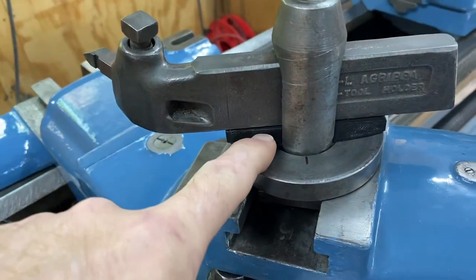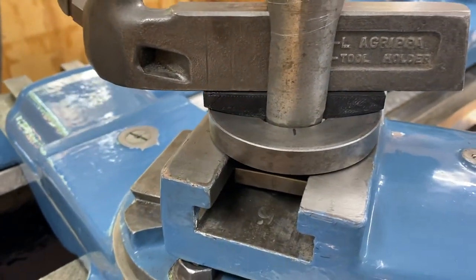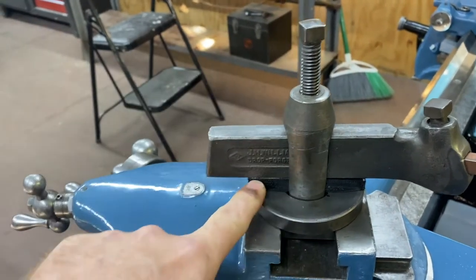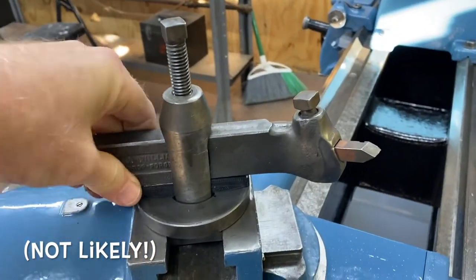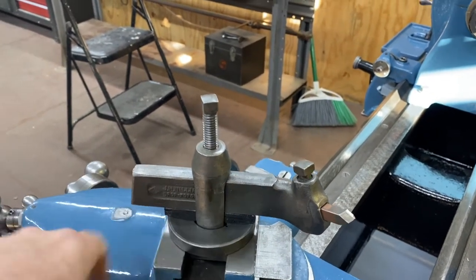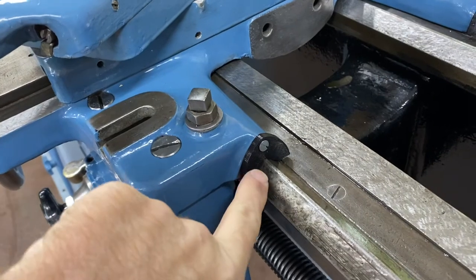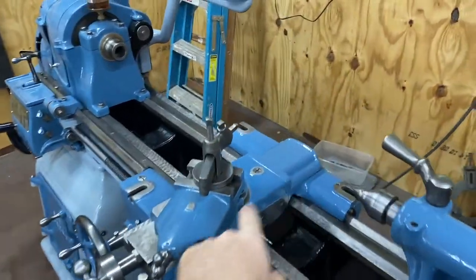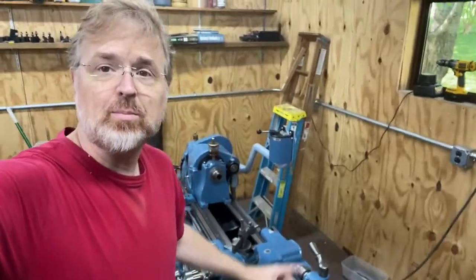This is my rocker-style tool post and I did not have a piece like this, so I made some measurements and some trial and error and found the radius is either 11 or 12 inches. I 3D printed that out of PLA plastic at 100% infill so it should be solid. Whether that's solid enough to hold actual cutting is another issue — I could use this as a pattern and just take a piece of aluminum and put that same curve in there. I really want to get a quick-change tool post. I've got these way covers 3D printed, I've ordered some felt to go behind that, and I put some touch-up paint on this area. I want to give that a good amount of time before I put the clear coat on.